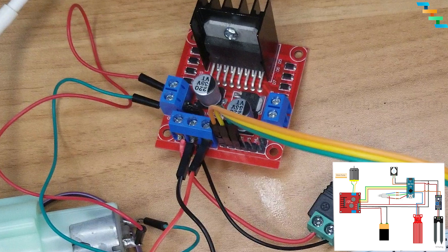We can control two motors with the L298N motor driver, but here we need to control only one DC motor water pump, so I am connecting speed control ENA of motor 1 to Arduino pin D6, which supports pulse width modulation — we can use it to control speed by providing variable values. Connect D5 and D4 to input pin 1 and input pin 2 on the L298N motor driver module. Connect OUT1 and OUT2 to the water pump DC motor. We can control the direction of rotation in the code.